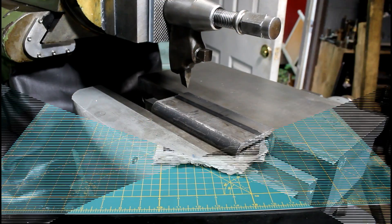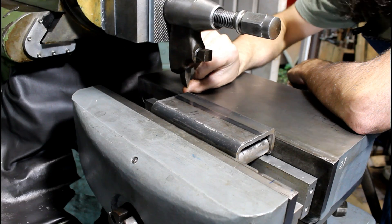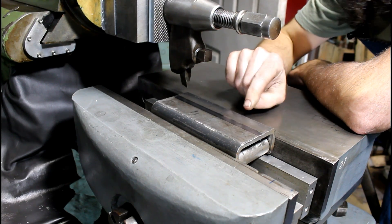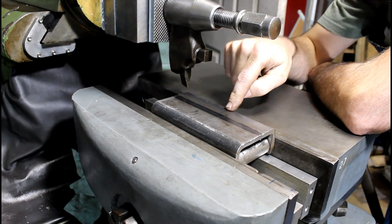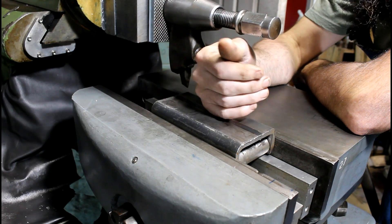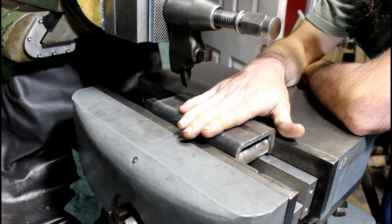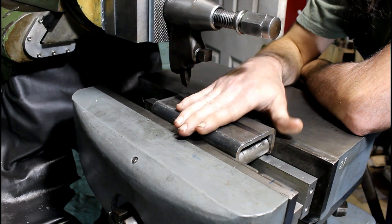I think if we texture this top it'll make them even better. This is going to be pretty simple — all we're going to do is use a flat bottom tool. We're going to go 20 thousandths deep and 150 thousandths per stroke, and then we're going to turn this piece 90 degrees and do it again. We're just going to give this a rough surface so it can bite into the bottom of whatever machine I move next.